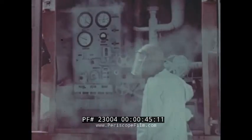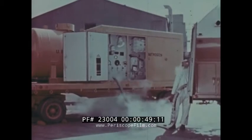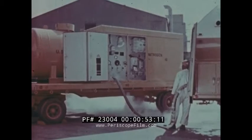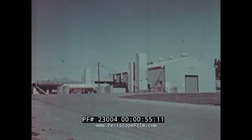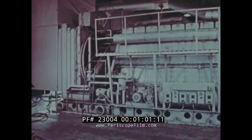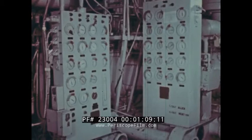The only difference is that liquid nitrogen is inert, does not support combustion, and is normally used for pressurization purposes. The liquid oxygen system at a typical Air Force base will include a generating plant like this one, in which the liquid is manufactured by the compression, expansion, and cooling of air taken from the atmosphere. Once manufactured, it is a cryogenic material.